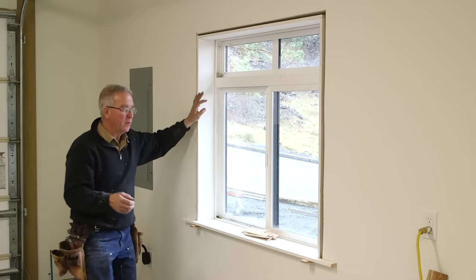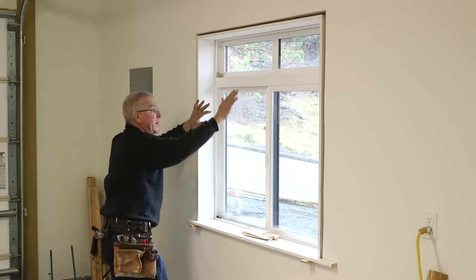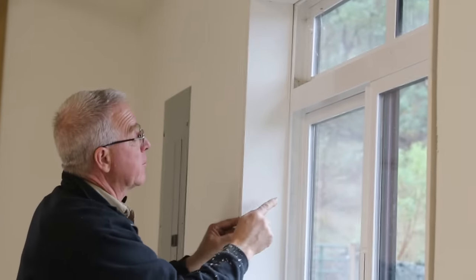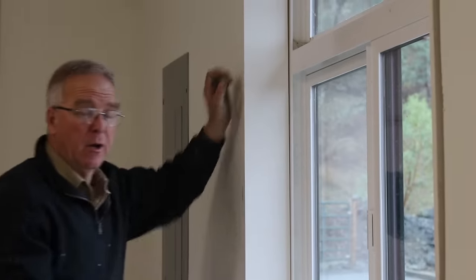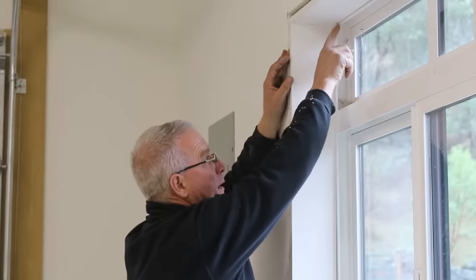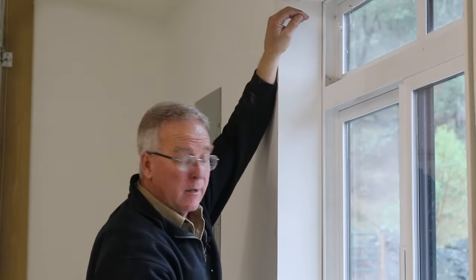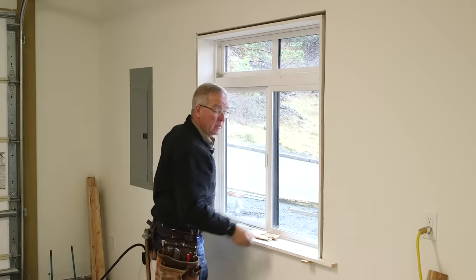This little jam assembly dropped right in — it went into the hole, there's still slack, the front edge of the jam is in a plane with the edges of the wall, and there is room to adjust the reveal. The reveal is the distance from the edge of this vinyl to the face of the jam. To get that distance, I took the opening measurement and then added two times what I wanted the reveal to be. So whatever reveal you want, you double that, cut your piece, and you'll have an even reveal top, bottom, and side to side if you do your math right.